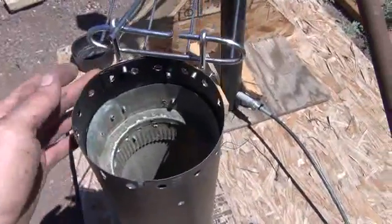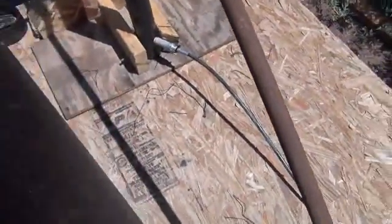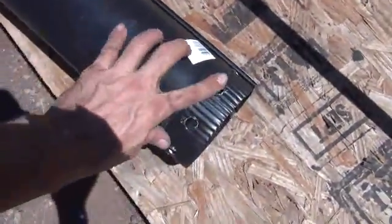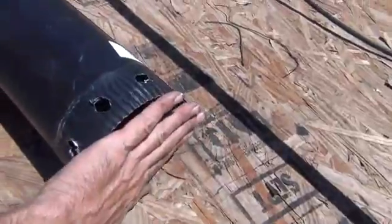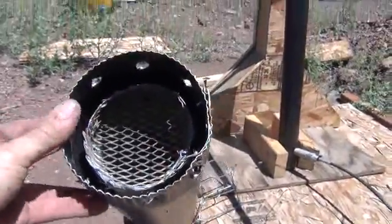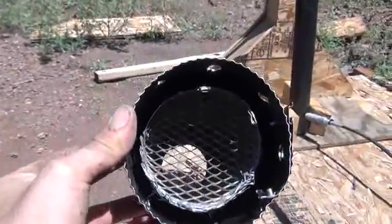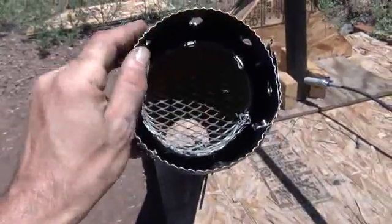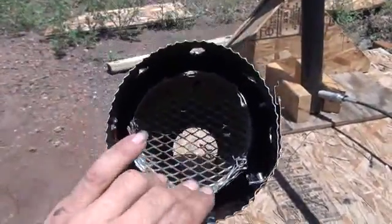We've got an outside set of holes here. This will actually add some more air in there and help the burn if there's anything unburned coming out. We have an exterior tube. If I flip this over for you — notice we have holes here, half inch holes at the bottom. That's going to be our air draw, so you can set this directly on a flat surface and it will draw air up through it. And here in the bottom you'll notice we have a double pipe system — an inner and outer pipe — and I've done an entire screen instead of a flat solid bottom because the airflow needs to be pretty good for such a long tube.